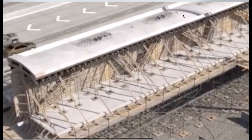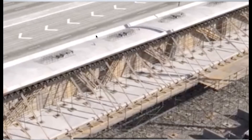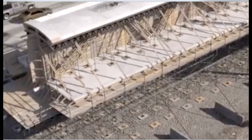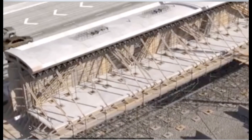The load path can come down, pass down this column under compression, and transfer its load to the base. With that said, this post-tensioning is part of the entire canopy — not just for the canopy though. Maybe it also helps support the load of the lower deck. If this lower part of the deck was all post-tensioned to support the loads of the lower deck, the top canopy, and the 16-inch pipes going to the cable-stay bridge — because they were dead weight — that's one nice setup where all the post-tensioning can take it.